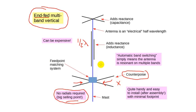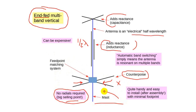The antennas are usually multiband, and so often go to great lengths to incorporate various reactive elements so that the antenna will have multiple resonant frequencies, one per band. The R5 was for 20 meters and above. Cushcraft continues to make versions of this antenna that include lower bands as well. I had an R5 for several years and thought it was a fine antenna. Note that you can install the antenna at ground level, or better, put it up higher in the air.